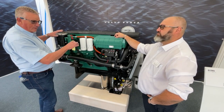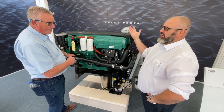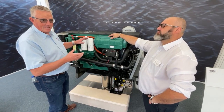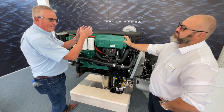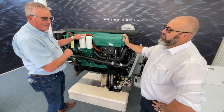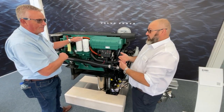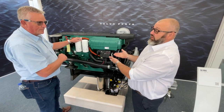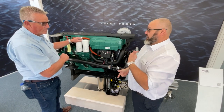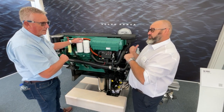From a servicing point of view, it's an annual service? Annual service, highly recommended because of the environment we're working in and the hygroscopic nature of some of the fluids — definitely worth doing every year. At French Marine we do a winterization and a recommission service. You would see us in the winter to make the boat safe for any freezing or cold conditions, flushing the salt water circuit through, and then in spring we recommission the engine, finish the other half of the service, and hopefully you'll enjoy your season and not see us again because you won't have a problem.